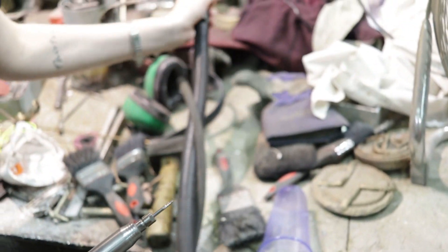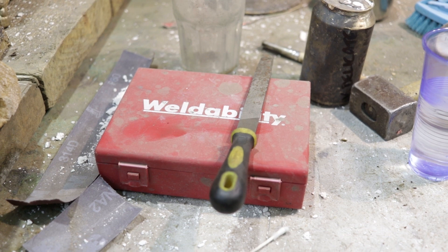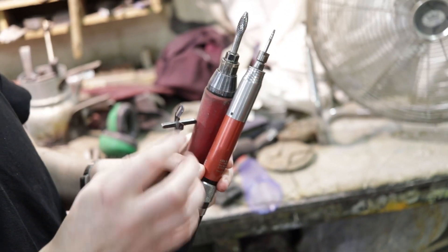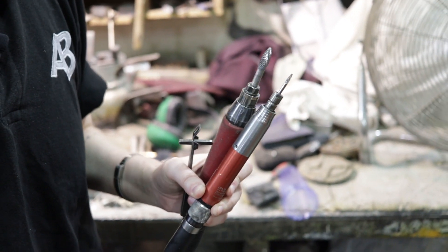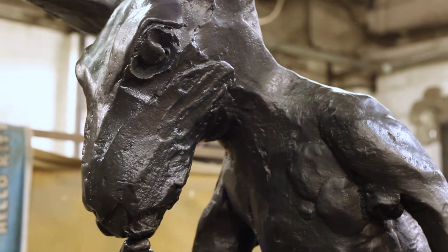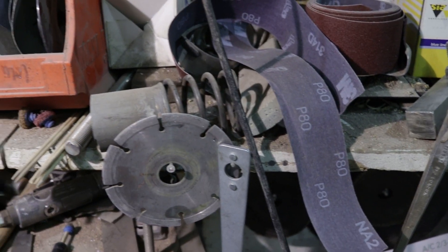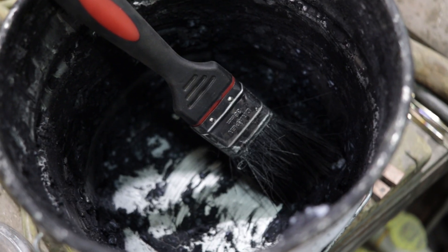We have larger ones as well for larger bits. Say we've got a couple of sections that have been welded together and you want to chase it back — any excess metal that you've added through welding, you want to chase it back with finer detail. These tools enable us to recreate that detail through comparing it to the original and to pictures. Larger pieces might have fittings and fixings attached to the base, or depending on where it's going it might need to be attached to the ground or any of those extra things — they happen to the bronze before it's been patinated.